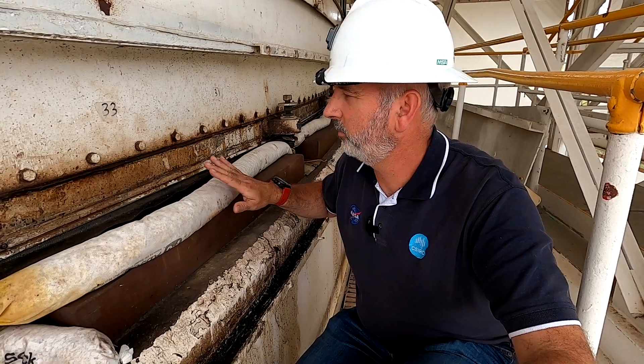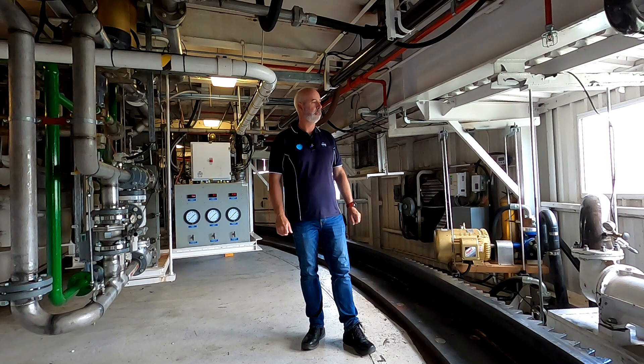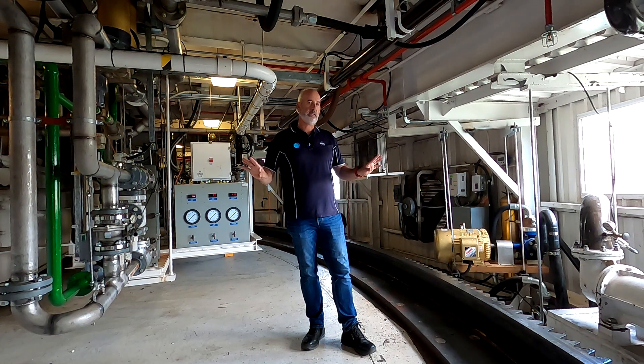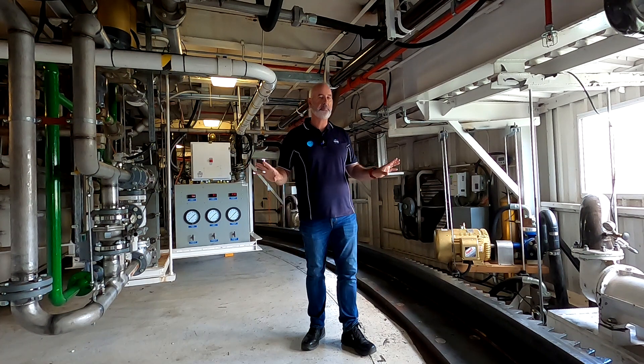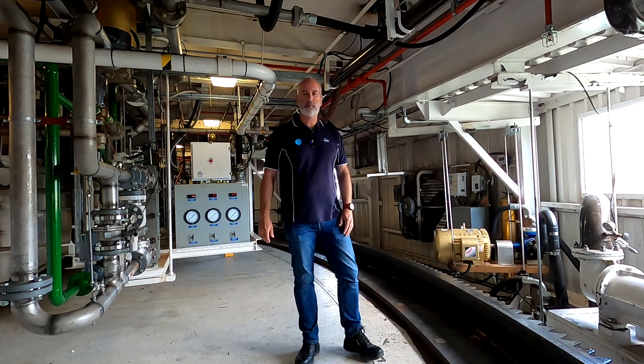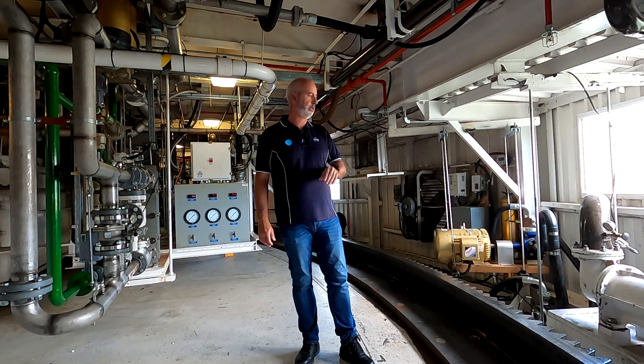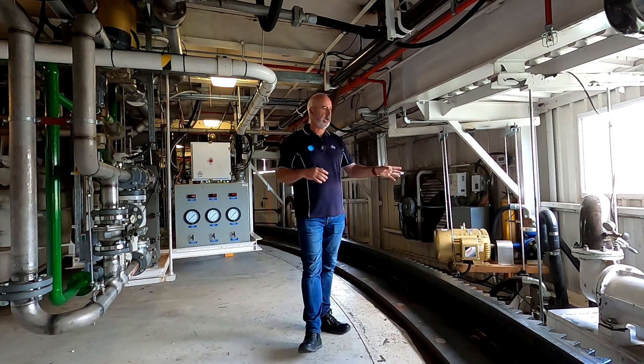That's what we can see from the outside. Let's have a look at what we can see on the inside. We've just come inside — we're in the bilge of DSS 43. We've switched the hydrostatic bearing off at the moment because it's a little bit loud, so we'll keep it down for a couple of hours just to make sure the oil doesn't cool down too much. Looking around, you see components from the two systems responsible for antenna movement — the bull gear here responsible for azimuth movement, and the drive units mated to those, as well as the hydrostatic components.